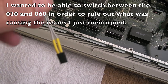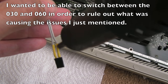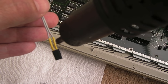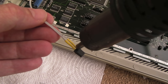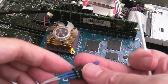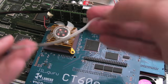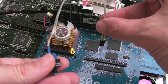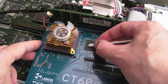The other thing I'm doing is making a switch to switch between the 060 and the 030 normal Falcon mode. I've got a little 2-pin connector — it still needs filing down a bit — but it should do the job. I'll shrink these two wires with heat shrink. There's my short little switch — I've isolated everything with heat shrink including the metal part. That should just plug onto that switch, and I could leave it internally or have it external to switch between the Falcon 030 and 060.